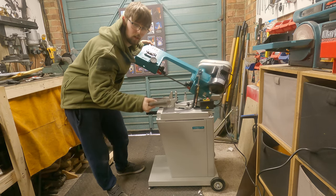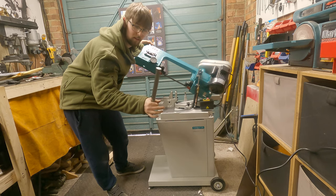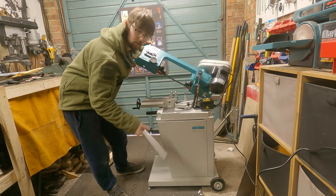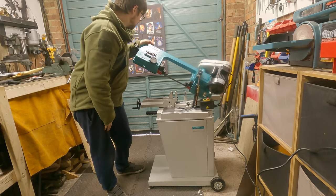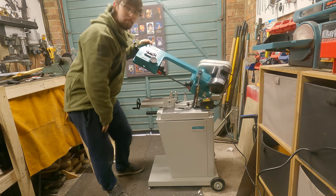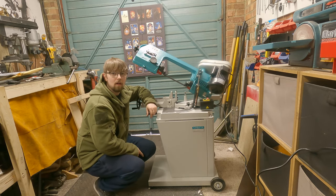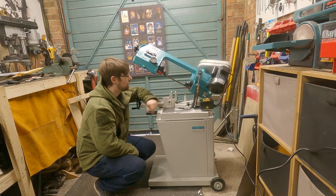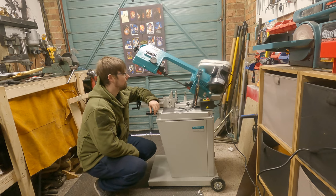Just quickly — you're probably thinking what can this machine actually cut? According to the specs on top, it just cut 25mm, but the maximum it can cut is 125mm — so that's five-inch solid tubing, which is insane. For box section it can cut 100mm box section — that's four-inch box section — no problem.